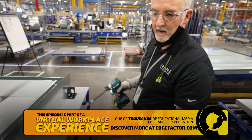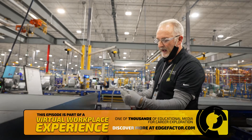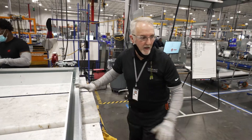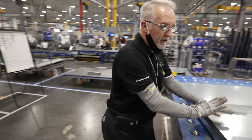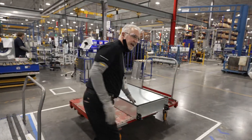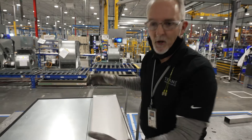We're bolting metal together, using a screw gun with sockets and putting on a lifting lug. After we build a frame, we pick up a panel, we build a base panel, and we drop it in — and now we've completed the base. We put a little gasket on it and drop in a drain pan, which catches any moisture that runs off.